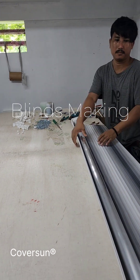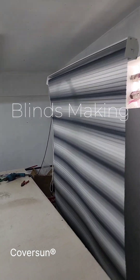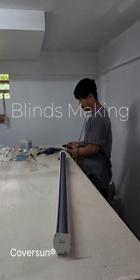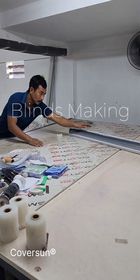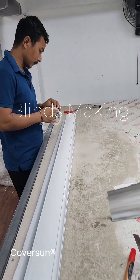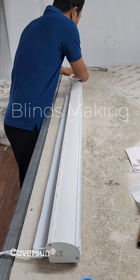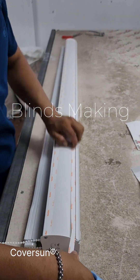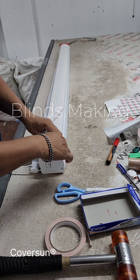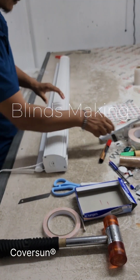You now have a working, durable, good quality blind. But the bracket color is white, so we need to use a fabric on top of the bracket and the pelmet so it will match the blind fabric. He will apply two rows of good quality double-sided tape and fix this fabric on top of the pelmet. The pelmet, aluminum bottom, and bracket all come in aluminum alloy. The clamp and side bracket come with metal — MS or something — but even so, everything is powder-coated with good quality.